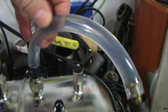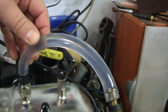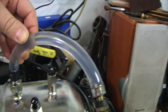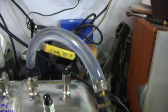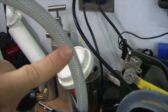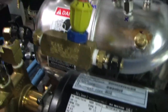I accidentally got the wrong hose from one of the soda suppliers — this clear thick stuff is good to 60 PSI. I would not recommend it for anything other than the intake side of the pump. These pumps can push out a lot of pressure, and this hose was designed for cooler temperatures. The nylon-reinforced stuff is what you want to use on any pressure side. This is all just mocked up right now while I test the pump and see how I want to configure things.